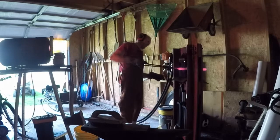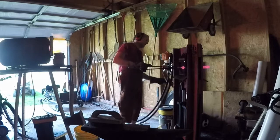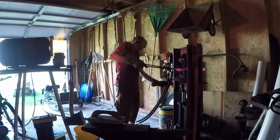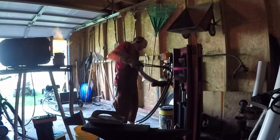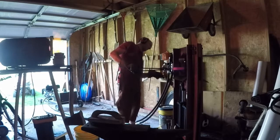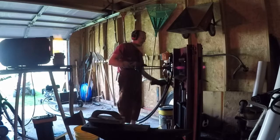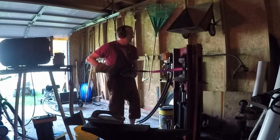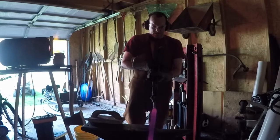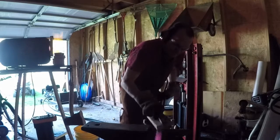I apologize for the not-zoomed-in view here. There's another set of welding passes I do a little later where I've got the camera a little closer to the forge so you can see what's actually going on with the metal. This is getting pretty close to the end of this pass. What I'll do next is clean the bar up, soak it in vinegar overnight to dissolve the forge scale, then grind the surfaces off, cut it up, restack it, and do this whole process a few more times.